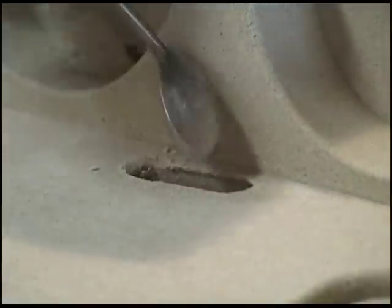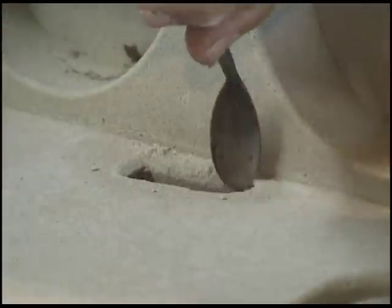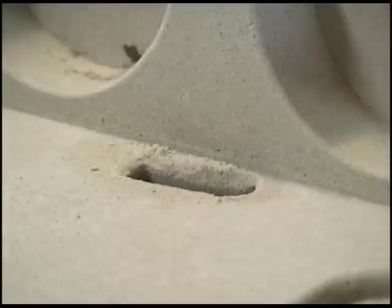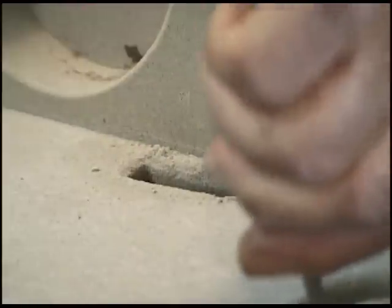We got to get a fillet around these risers, otherwise it will show an indentation mark into the casting. Oh, because it'll suck back? Got to get suck down. We got to go down in here a little bit with a rod down in those deep guys to check those.